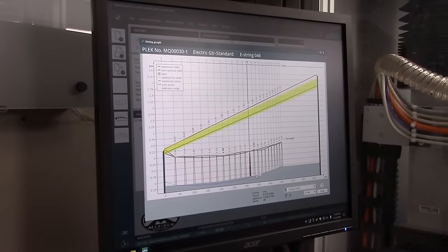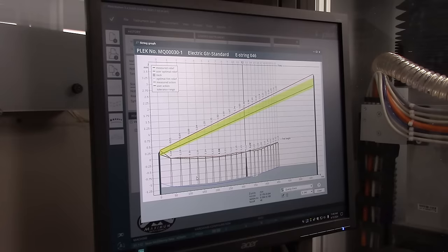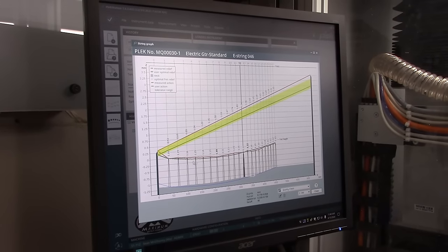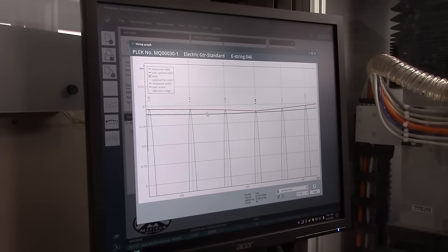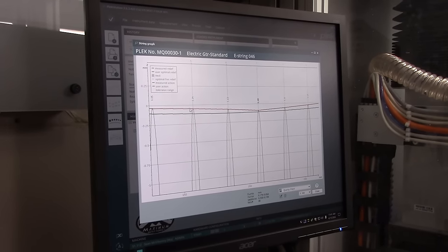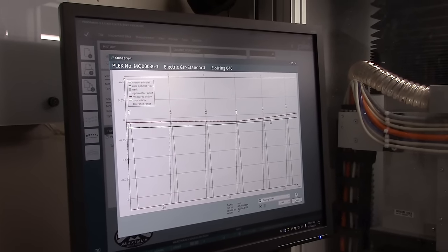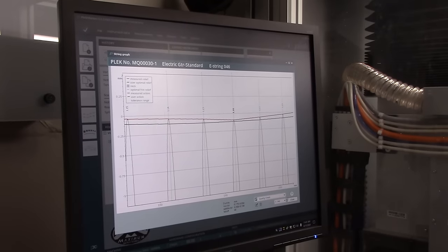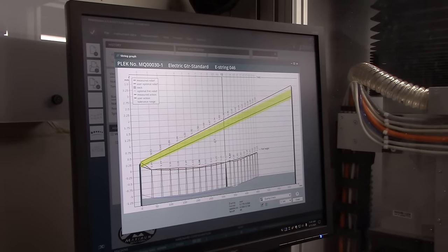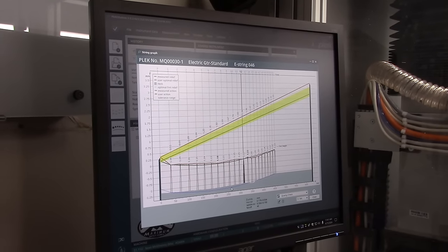So we could try to take some of this out by adjusting the truss rod first and get it closer, and that may also help some of this area come into play, because again, the red line is showing where it is, and this is showing where it should be in order to have optimized playability for the action that you want. Make sense? Yep. All right. So I would recommend that we start with a minor truss rod adjustment. Yeah, I think it needs it.